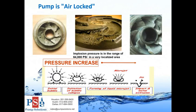This is what impellers look like when pumping water with air in them over time. When you pump air, air bubbles form; when pressure increases and those bubbles turn to liquid state they burst, pitting away at your impeller. Eventually they can look like Swiss cheese. Here's what impellers can look like from being air locked or pumping air.